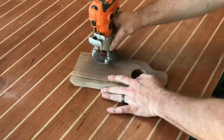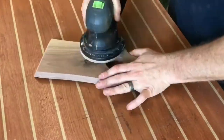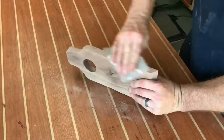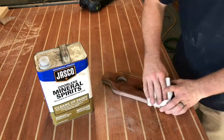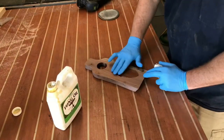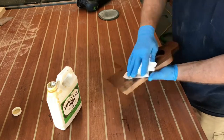I make my way back to the router and put an eighth inch chamfer over the entire piece. Give it a nice sanding, get rid of some of those pencil marks, and now it's time to apply some finish. Just before finishing, I like to go over with some hand sanding — this is 220 grit, that's pretty much all you need for this kind of piece. Mineral spirits is applied to clean up all the dust and reveal the grain and color that this walnut is going to have. Once that dries, I put a liberal coat of tung oil on the front, back and sides and rub it in. Tung oil is beautiful on walnut.